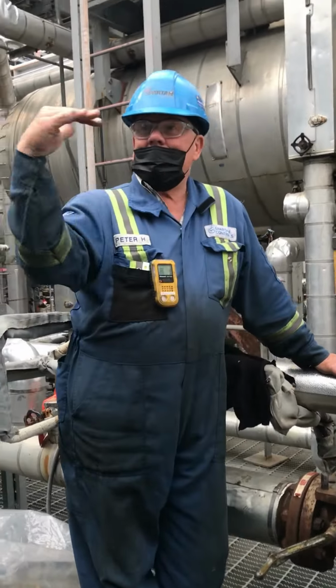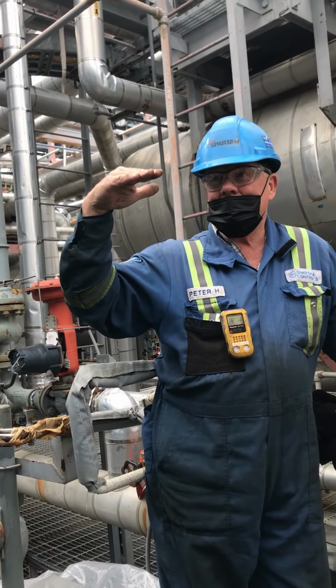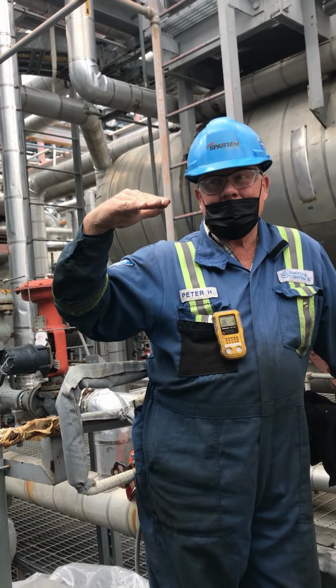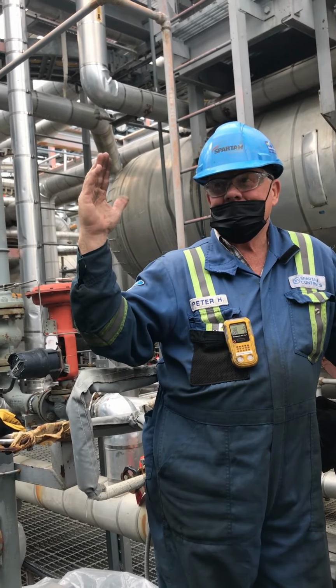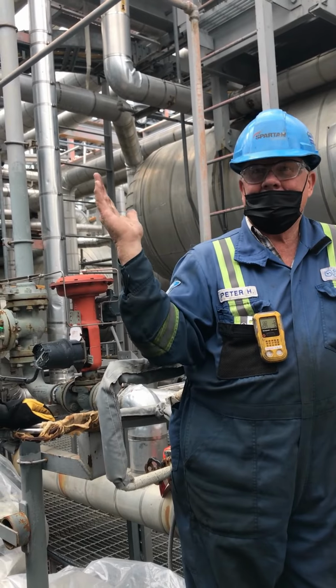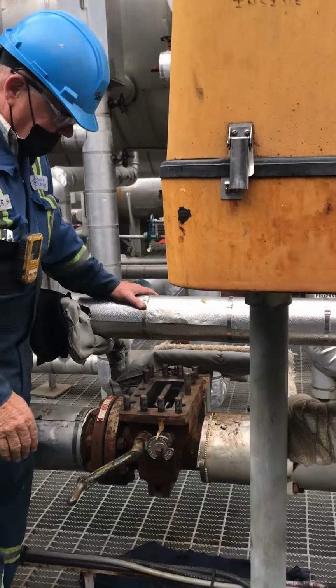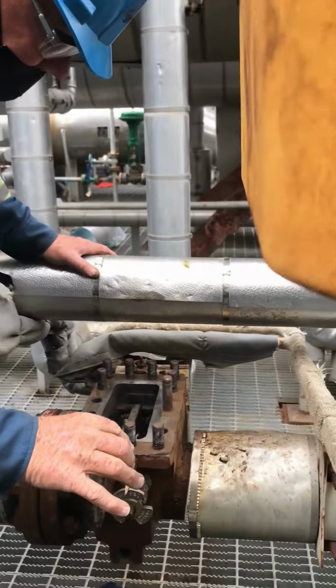This size and even bigger ones really matter because it can be out one tooth and it looks good. But it's out one tooth, it'll go down, but it won't come back out. Then you got to take the head off. Can't close the gate, you're screwed. All right, just by not paying attention how it goes in. Okay, so that looks good. We're going to run it down.